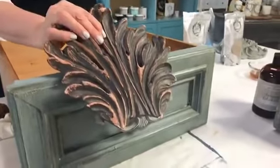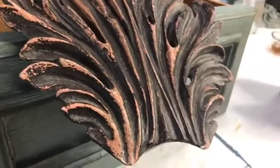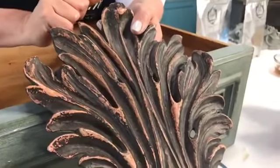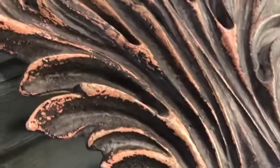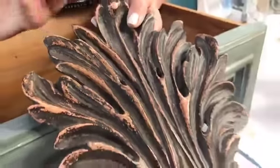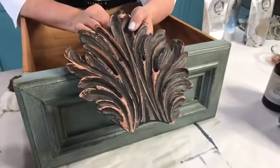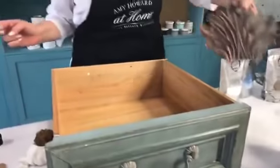Here are a few examples. Start dissecting this piece — what was the first color? It's that little peeking-through color: Toulouse Rose. I put a coat of Toulouse Rose over the entire piece first. After it dried, I put on a coat of Noir black, then wore it off with the antiquing glaze. That gives a very natural worn finish without looking contrived. I don't use sandpaper at all on this.